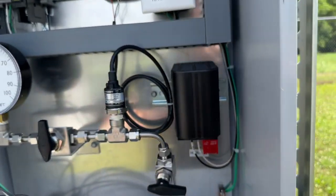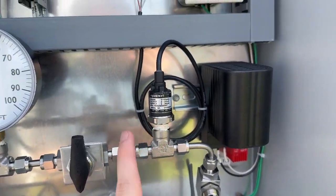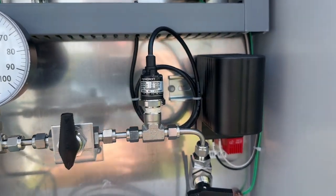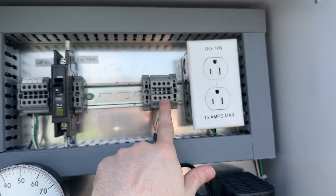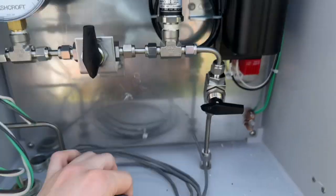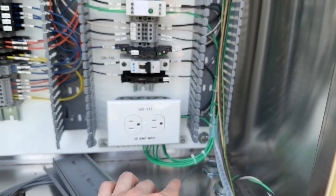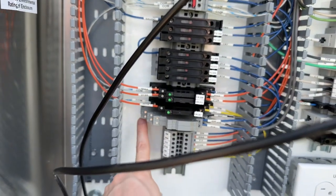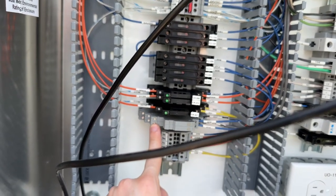It's kind of like an oxygen sensor on your car - when exhaust temperature is low, it reads a low voltage. If it's really bad, the signal will drop below 4 milliamps, which tells you it's not working at all. The 4 to 20 milliamp signal comes in through here to read the pressure. I have to wire this cable all the way through these pipes and into the three terminals: bottom is ground, second is common ground, and top is power.